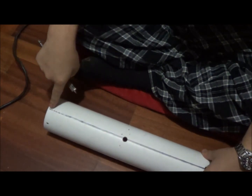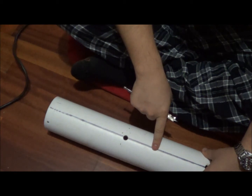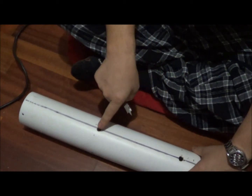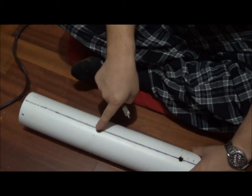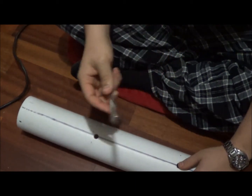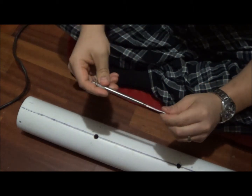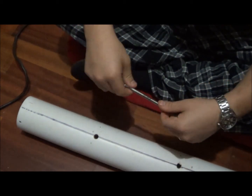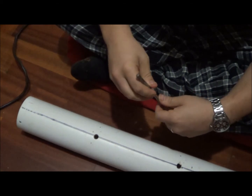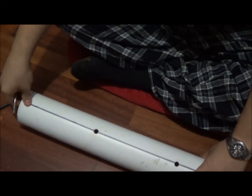What I did was I put the two pipes together after I cut them, made a line down them so that I had a straight line, and then I took my tape measure and went back every 8 inches and made a dot — that told me where to make my hole. I used a 7/16ths paddle bit, or butterfly bit, whatever you prefer to call it, and I drilled those holes every 8 inches apart on all four sides.